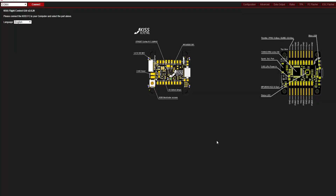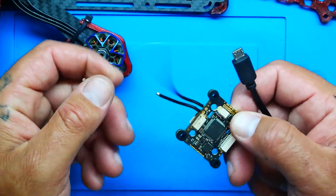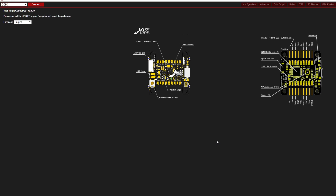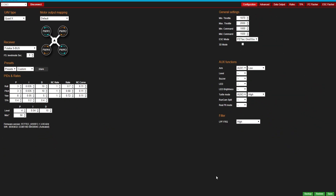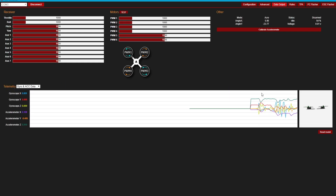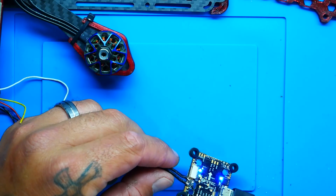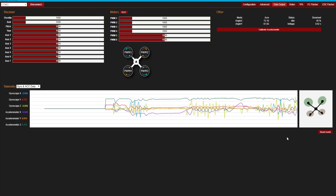Here in the PC, I grab a USB connected to the computer — this is the broken flight controller. I plug it in, and jumping into the PC you'll see my COM ports are up. I have options for three and four. I'll choose three and hit connect — and there you go, I'm connected. I'll head over to data output, and you can see this proves that my microcontroller unit is on, it is communicating to my gyro, and everything is perfectly fine. When I shift this around — look at that. This is a perfectly good flight controller; it's just not powering up.